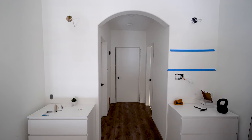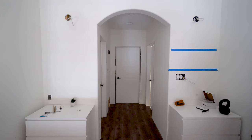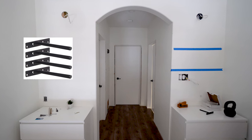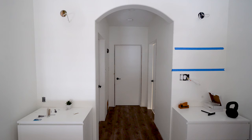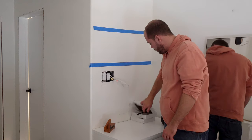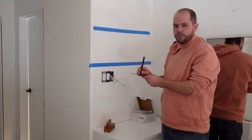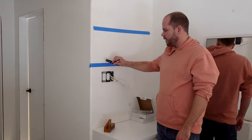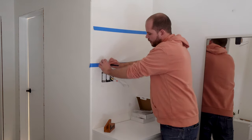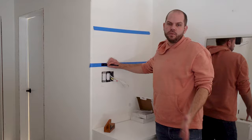This is the loft upstairs where we wanted to add some new floating shelves. We'll be using some metal brackets that we got off Amazon — we'll include a link in the description below — and then we'll also be using some solid oak slabs left over from another project. These floating shelf hooks just get screwed into a stud, then you make a hole into the floating shelf block and a little groove on the back, and they just slide on. It works really well.